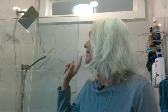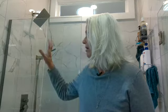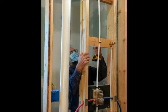So today I want to talk about the shower head shower system install and a couple of key things that we learned about this, because a number of you have mentioned that you're hoping to do a shower renovation and wanted ideas for that. First of all, our back wall is 6 inches, 2x6s rather than 2x4s to give us enough room for the venting pipes and all of the adjustments, insulation and so on. So I recommend that when you're dealing with plumbing, you're always using 2x6s instead of 2x4s.